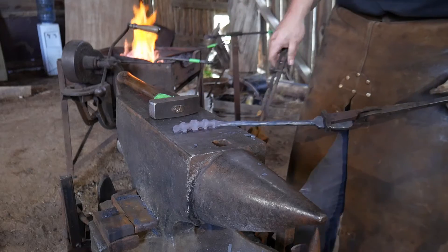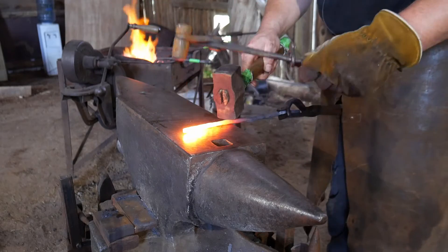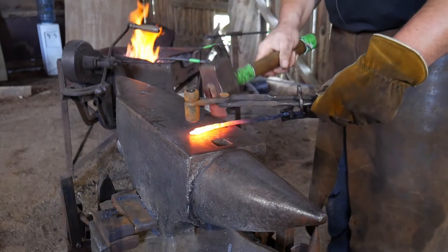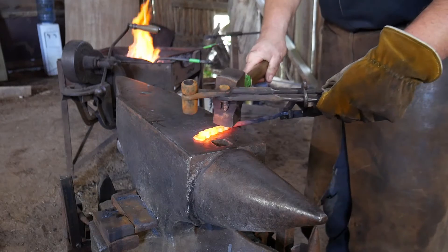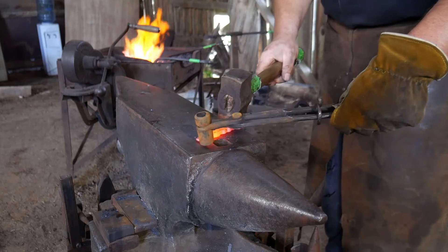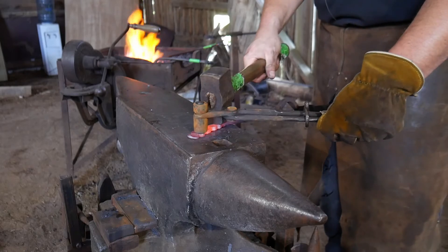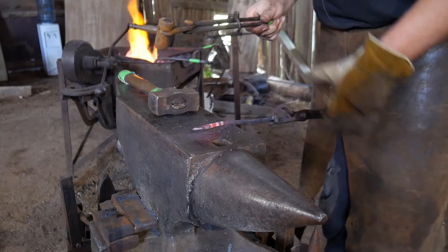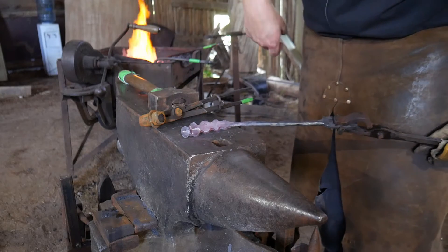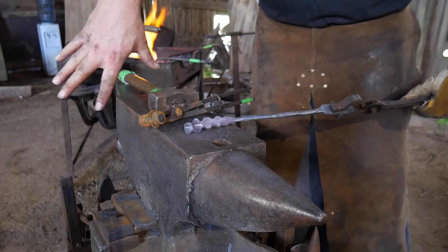Make sure you've got a good secure grip. I'm going to hold the piece myself between my legs on the anvil. We're going to start out at the very tip, driving our lobes out and forward. It's not going to look like you get too much travel right now, but you'll get more travel once we go to using the cross peen to draw the piece out. You want to hit just off-center with the radius of the ball. You can see how that's starting to divide the material up and spread those lobes out - that is exactly what we're wanting.